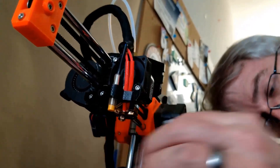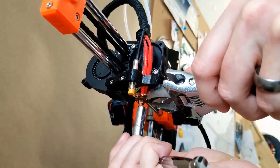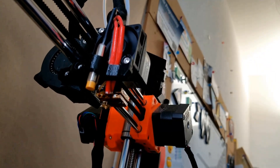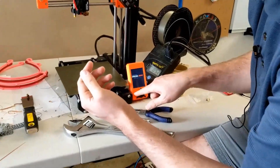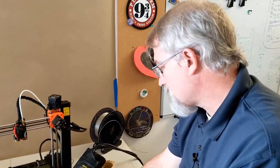I don't want to be too tight because I don't want to twist. I don't really need to crank down on it, because once it cools off it'll seat better. I'll orient it and be careful touching your hand after you do that because it's still hot. So now I'm done. I'll just hit reset and let it cool down. I'm guessing the nozzle height is going to be a little different, so I should probably reconfigure my offset on the Z-axis — do a first layer calibration. So I'll go do a first layer calibration, and then I'll start printing some miniatures with a 0.25 nozzle and a 0.05 layer height, and we'll see how they turn out.